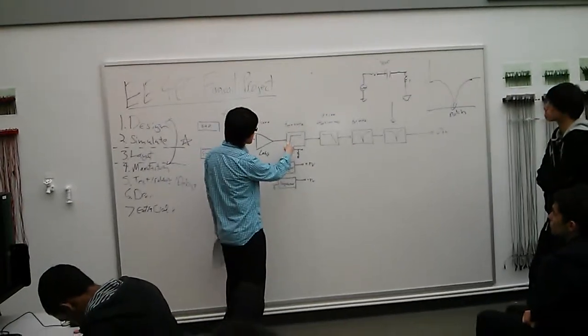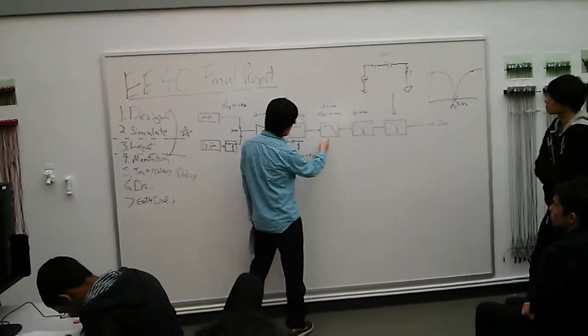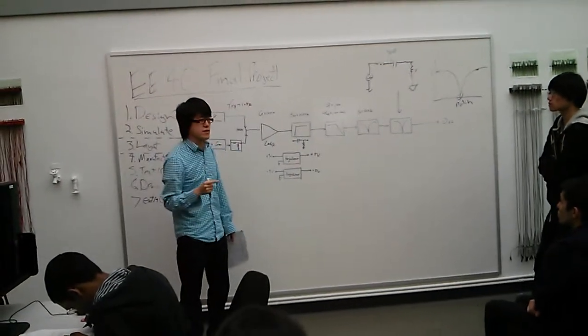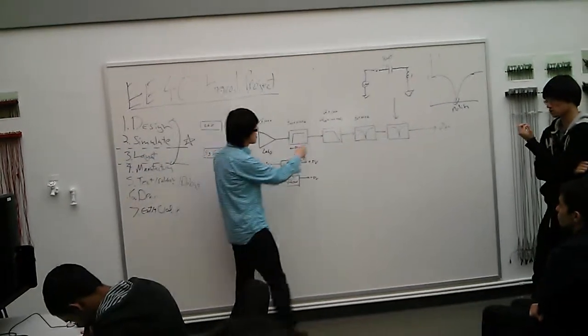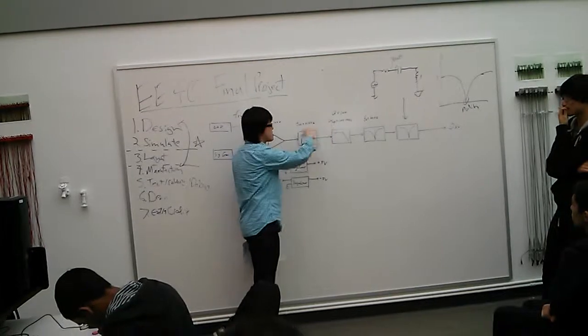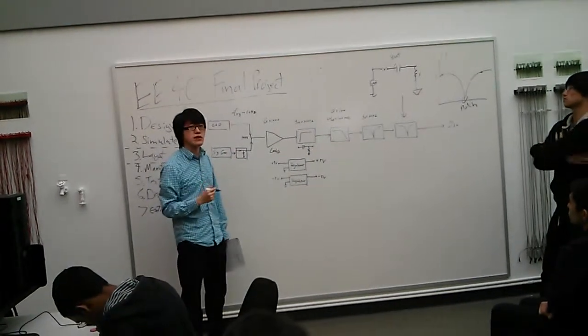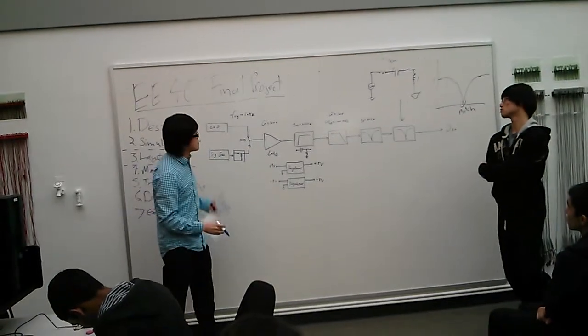So this is a high pass. After the high pass, you build a low pass filter. It's an active one. I think you already see that in the menu. The cutoff frequency is 1,000 rad per second. Remember, it's omega, it's not f. Okay, so choose the RC value that gives you this omega low pass filter corner.